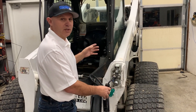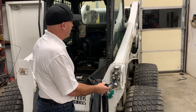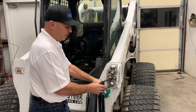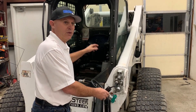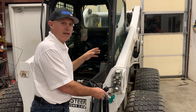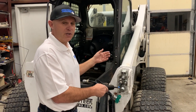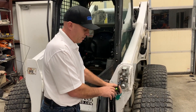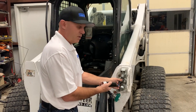This controller can also be reprogrammed. The sequence is: hold down the button you want latched, then turn the key on and off. It'll make two of the channels latch on, so you touch a button and it stays on — take your hand off and it's still on, touch it again to turn it off. But they ship without that feature, so you have to turn it on through the software controls; otherwise they come with momentary controls only. This one is still flickering, meaning it's live, the bus is active, and it's talking to the machine.